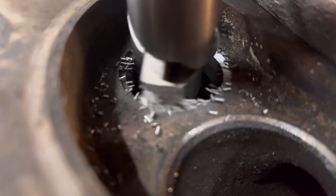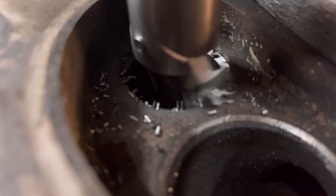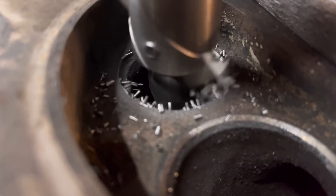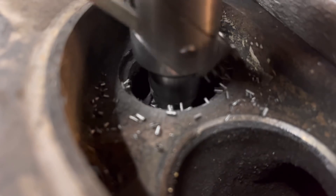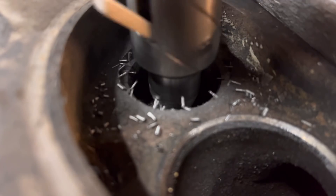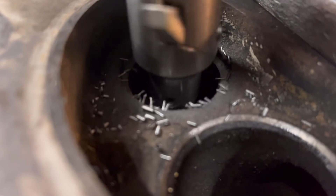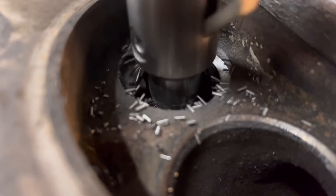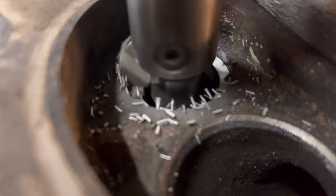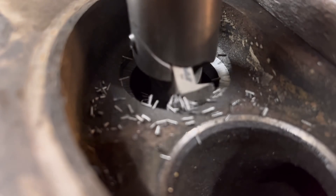I'm just going to rough the rest of them out. I sort of do this more on feel — I don't cut on too deep a cut and you don't want to put too shallow a cut that it's not going to bite into the cast iron. Depending what material needs to be cut depends on how fast you feed it. Roughing out like this I normally have the speed pretty much wide open, which is about 200 surface metres per minute. I've got the stop on the depth about 1mm shallower than the actual depth of the insert so the insert slips out a bit.